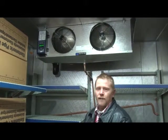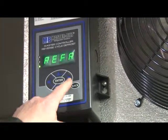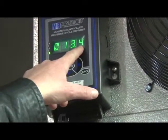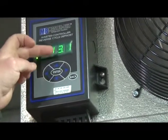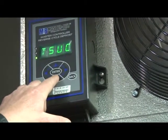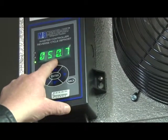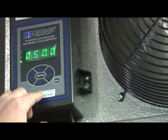We're going to do the same check in the freezer to verify operations. So now we're going to verify the operation of the freezer very quickly. See that our superheat is about 13.4 degrees. The system just cut back on, so it's not uncommon for it to be a little bit high, but you can see that it's steadily trying to drop — now it's down to 12.8. Our valve position is actually about 50%, so we probably will have to add refrigerant to this system to complete the charge. We'll do that and then recheck these settings.